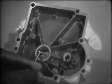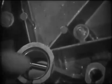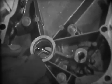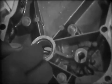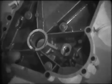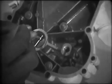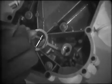When measuring bearings, be sure to take a clearance measurement near the top and another clearance measurement near the bottom to determine the taper. Also, be sure to take two additional measurements at a 90-degree angle from the first two readings to determine if the bearing has worn out of round.